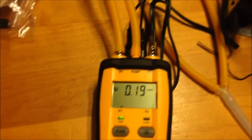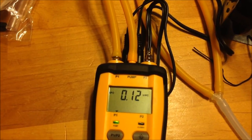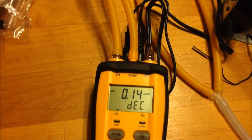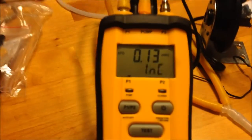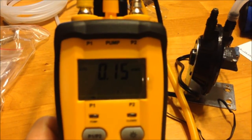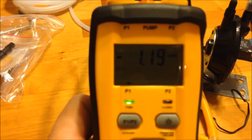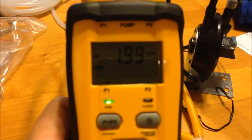I'm going to make that go all the way down to zero and back up again. Now we're going to increase it — just holding down the INC button, it's starting to pick up. Hit the hold button — they say the hold button will tell you what it's at when it trips. We're way above what it should be, so it's already condemned in my book.